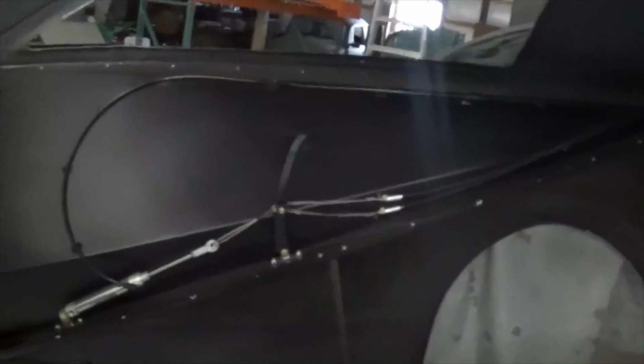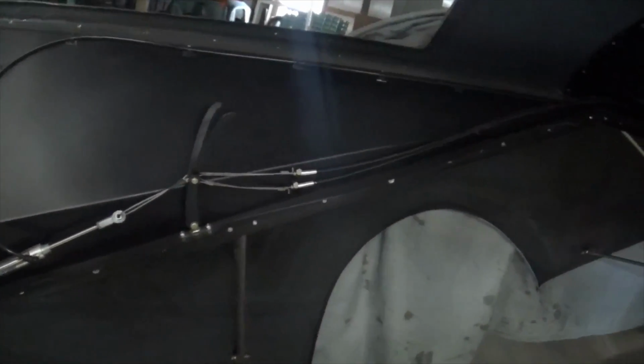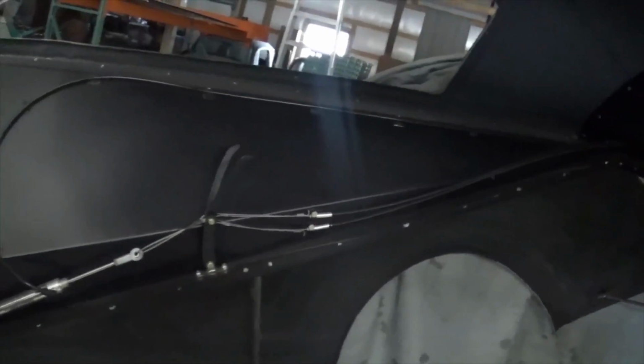Parachute handle stuff over there on that side. Again, I'm not happy with that. Unfortunately, a lot of guys do it that way. It's clean, but I'm not real hip on a cable going through my Bimba cylinder and wrapped around my parachute handles to pull the chutes in case the RF system goes off.